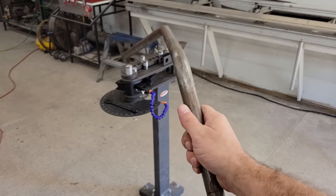I cut all the braces from 3 quarter inch by 0.065 inch thick wall DOM tubing and held them in place with some tape before tack welding them. The idea here is to triangulate the space between the top and bottom tubes because the triangle is the strongest shape. A load placed at any point of the triangle is going to be diverted to the other two points and shared between them — it's a self-supporting structure.